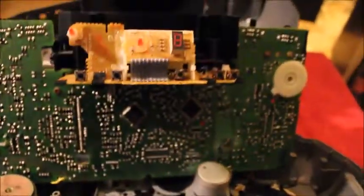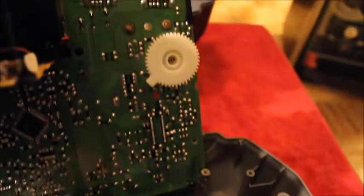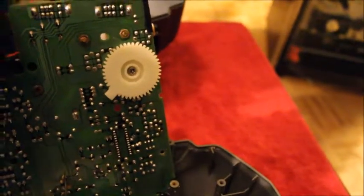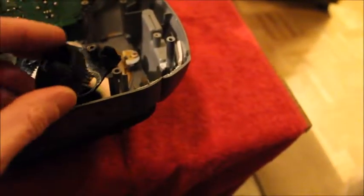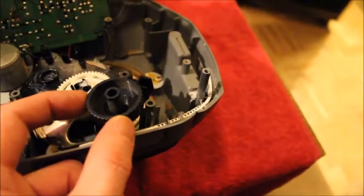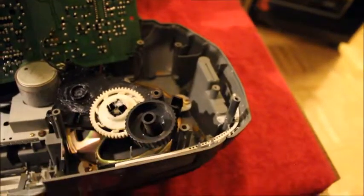You can see there's just a plastic gear here that drives the tuning — a cheap plastic gear which touches another gear. When you have this knob in here and you turn it, that turns the gear which touches the other gear and tunes the radio. That's your tuning mechanism.